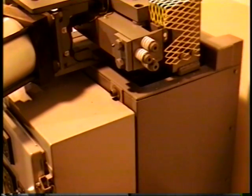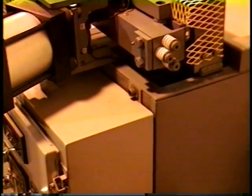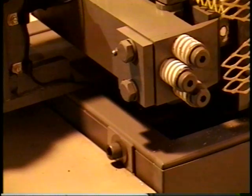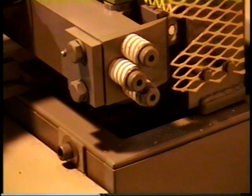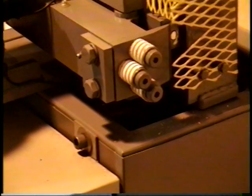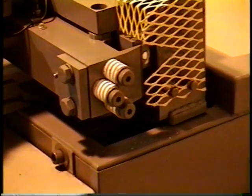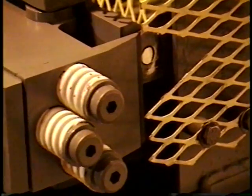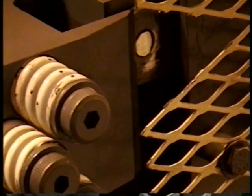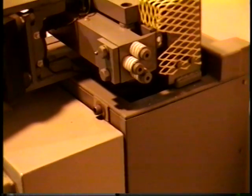It's being contained with three die springs. The shoulder bolts that retain the die springs are cleared so that the compressive loading on the cutter as it's cutting the rod is absorbed by a backup plate — also heat-treated A2 steel — such that we don't have a wear condition existing between the shoulder bolt OD and the ID of the holes in the chopper cutter. The guide can be seen with a remnant of rod still protruding from the last cut. It's a very high-quality surface, and that's one of the reasons why we can enjoy such statistical precision in terms of cut lengths.